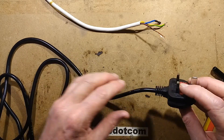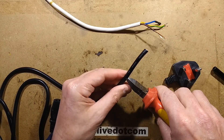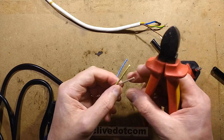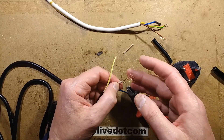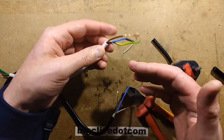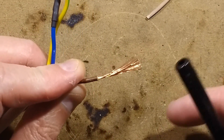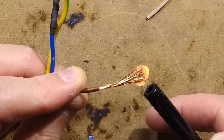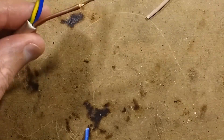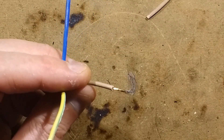Bonus extra footage - let's test the cable. I'm going to chop off the faulty sleeved-earth plug. The cable stripped easily - we'll do the flame test to see if it's copper or copper-coated aluminium, and ascertain how thick it is - it's supposed to be 0.75mm. It feels spongy though. Let's do a flame test: with a known copper cable, as it heats up it should glow red hot but shouldn't malform in any way - that passes. Now let's try this cable - and it's copper-coated aluminium, it's all just flopped. So that cable's going in the bin.